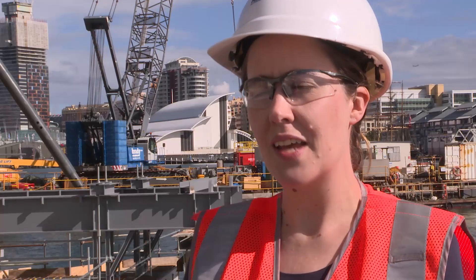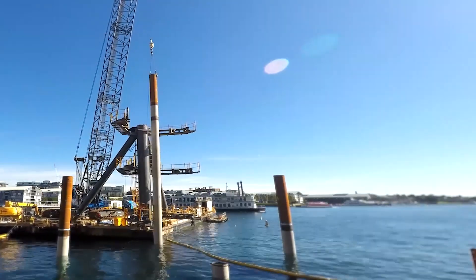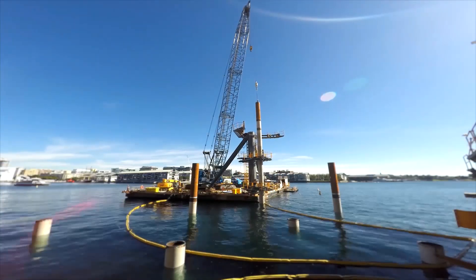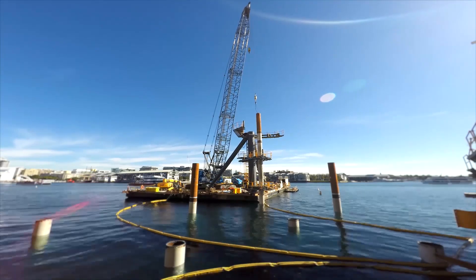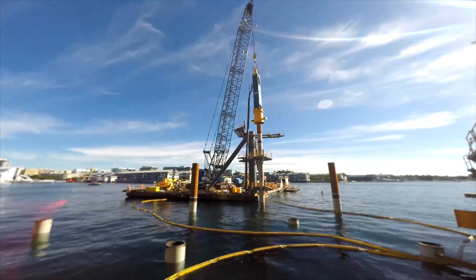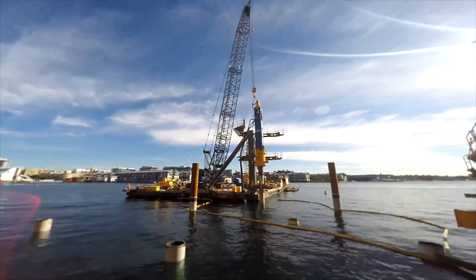The piling process has various steps. First the crane lifts the pile from the barge onto the piling guide. The crane lowers the pile into place. When the pile is released it moves under its own weight some distance into the seabed. The pile hammer is then attached to the top of the pile, and the pile is hammered into the seabed down to the required rock level.